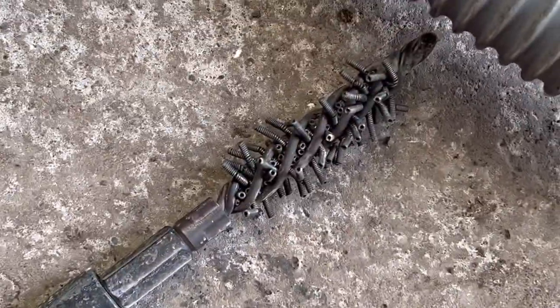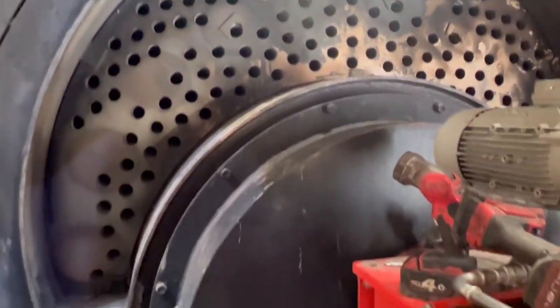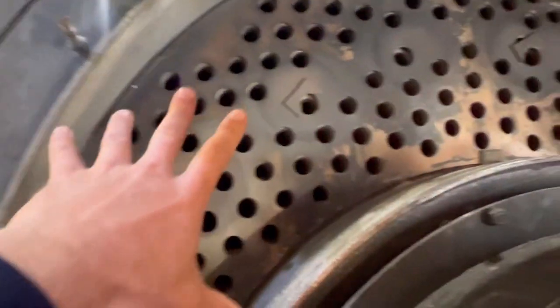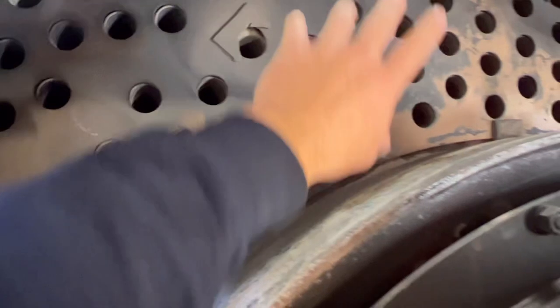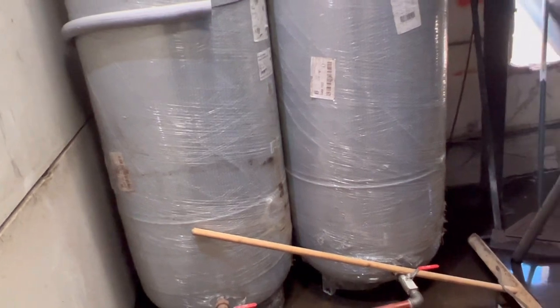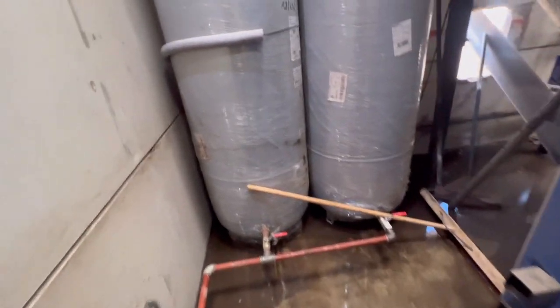Chris has been cleaning it out with this motorized big pipe cleaner - you slide it down the tubes and clean all the dust out. When it's burning hot inside, the water is around all these bits and hot air goes through the tubes to heat the water. This is a blast plate because these shot blasts fire a shot of air to clean the tubes out. But because there's quite a lot of soot and ash in the air, it was wearing a hole in the actual boiler. So this is like a sacrificial plate - and that's where it's worn and he's patched it up last time. The lads have got the new ones in now, lined up. They used to be one bit smaller, now there's two. So they're all ready to go - hopefully it'll hold its pressure better now.